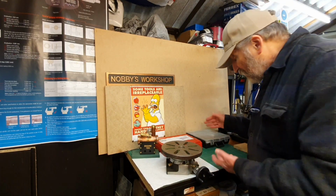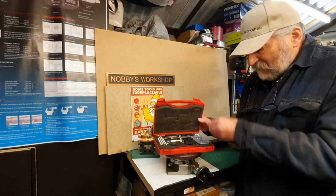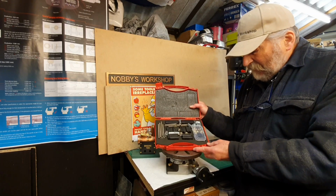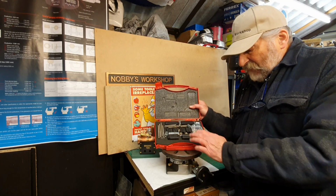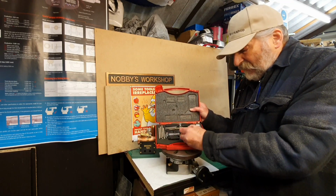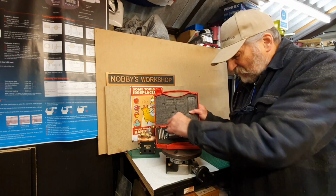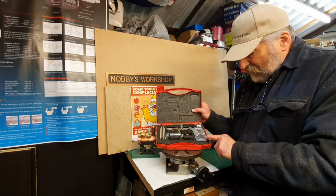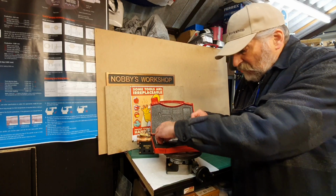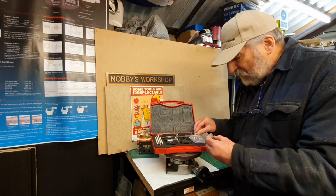And to hold it down, obviously you use these clamp down sets. This is the most recent set that was bought by my wife for me a few years back, and it has various clamps and threaded studding and flange nuts and so forth, and I bought a lot of extra flange nuts, always sort of useful to have. And it has some little T-nuts in here as well, these devices so that you can join bits of the studding together if you need a much taller piece.